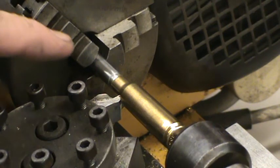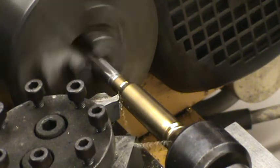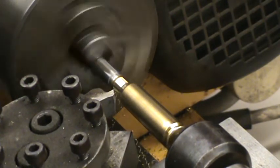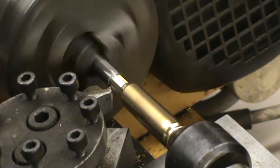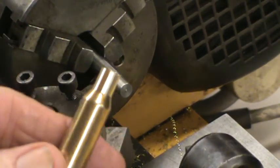I've got it set right where I want it. It does put a small scratch on the brass, but once you turn it you'll never see the scratch and it doesn't hurt it at all. I'll turn the lathe on, hit the auto feed, and show you how I'm turning necks on this brass. There it goes — does a good job, doesn't take very long. I sharpened this bit myself, got it good and sharp.